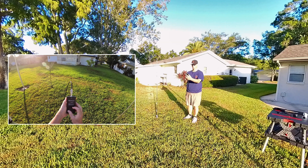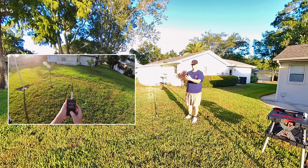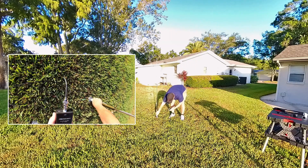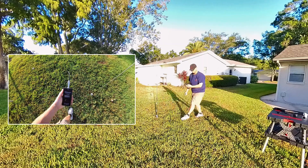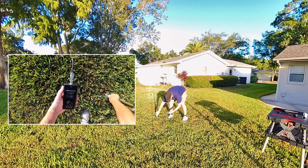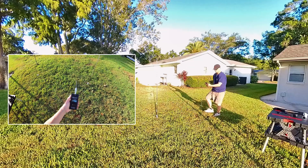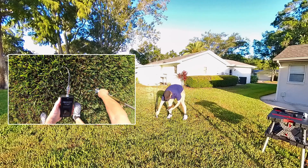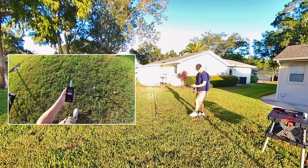Now let's go through the actual process of tuning the antenna using the analyzer. I dial in the frequency I want to operate on — that's what I want the analyzer reading. I make a minor adjustment on my coil, step back away from the antenna system, check my SWR, and if it's not quite where I want it I go back for another adjustment. You repeat this as many times as needed until you have the reading you want. That's how you tune a coil antenna system and use this new analyzer from Chameleon Antenna. Hope you found this useful — 73.